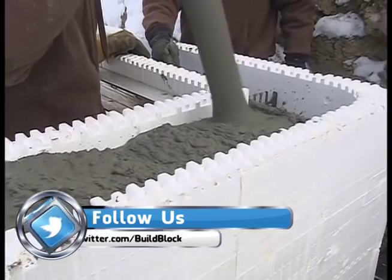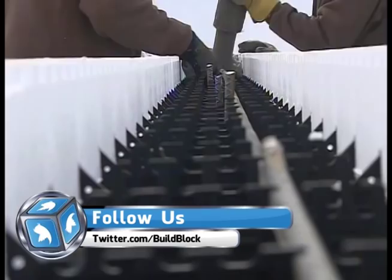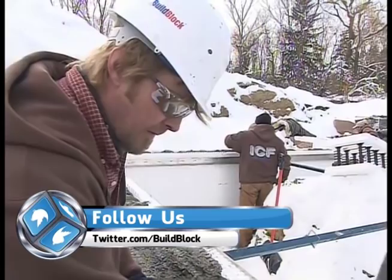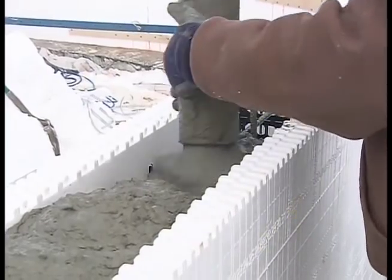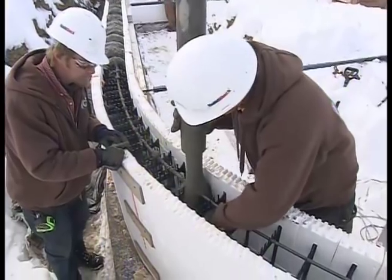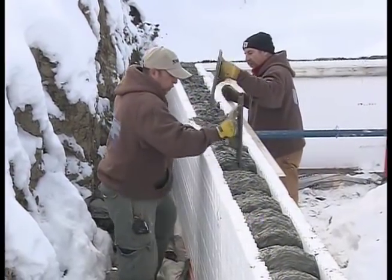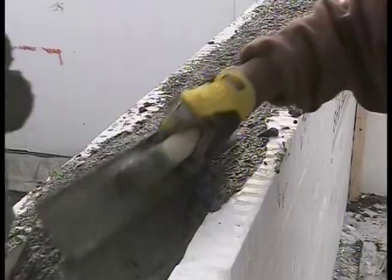Your concern though is if it comes out too cold, it could freeze before it really gets to the bottom of the form — you end up with honeycombing. If it's really cold it could freeze before we could screed it, and if it's below 40 degrees it just doesn't set up. What's Brad Kwanbeck's watchful eye looking for before this is happening? We want to make sure the walls are straight, plumb, and square and nothing's moving. The bracing the guys put in is awesome — everything is so solid before the truck even shows up.